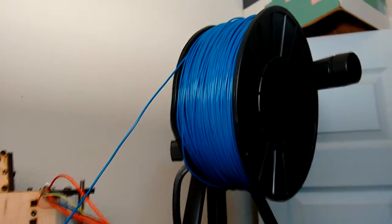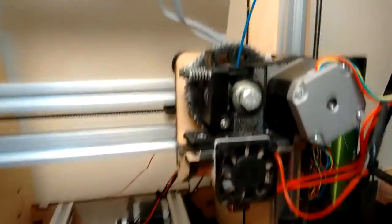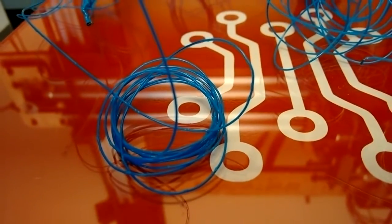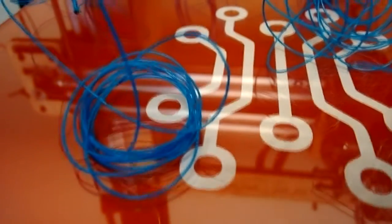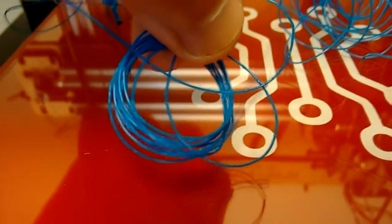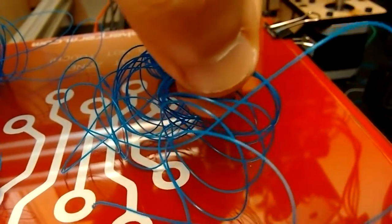So I have the roll that just came out of the oven loaded in the printer, and I used it to extrude a little more filament — I'm actually calibrating the e-steps. If we look at the filament from before, you can see all those steam bubbles, caused by moisture in the filament when it went through the extruder and heated up — the water turned to steam and caused a bunch of little bubbles. The filament is really rough with bubbles. But looking at the freshly extruded filament after drying, there are none of those bubbles whatsoever. The drying went very well.